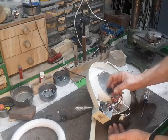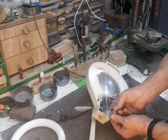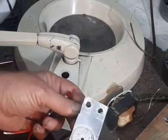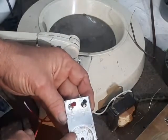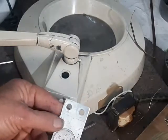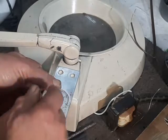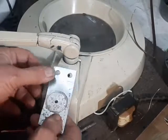Here we have our switch, which has fallen apart — that's no big surprise. This is actually two switches in one. This kind of work is when a magnifying lamp actually does come in quite handy. This is a piece of 16th-inch aluminum plate I'm going to use to make the switch plate. When you're working on something with small details like this, it's usually easier to start with a big piece, make all your cuts and holes, and then saw it off. I'm going to have to drill some holes in the original lamp, and that's when it really gets serious — I can really only drill holes once. This switch plate will cover up any raggedness or anything slightly off-center.